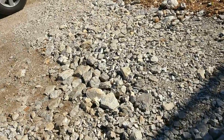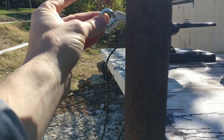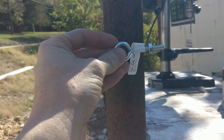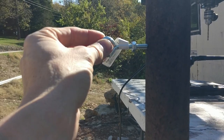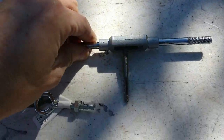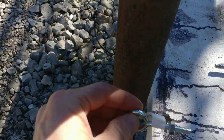And so my thought is, I'm going to start with an eyelet like that. So if you can think of it, it's going to be in there like that. I can't have anything on this side of it because it's going to be too close to my house, and I need to do the same thing upstairs, but I have that landing mat on the back of it, so I can't get a wrench back there. So my thought is I will drill, and then I will tap like that, so then that can thread into it, so this will be a threaded connection like that.